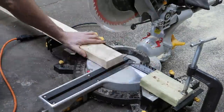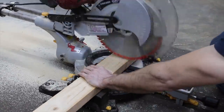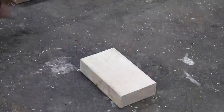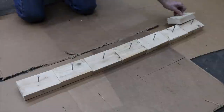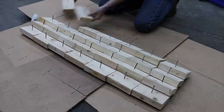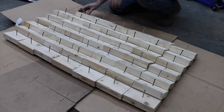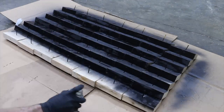The first test we'll be conducting is to test the holding strength of each type of nail and then each screw. I'll be using untreated 2x4s from the same stack of lumber to help make sure the test results are accurate. Since wood varies a lot, we'll be testing seven samples of each type and throwing out the high and the low numbers to get rid of the outliers. I'll be driving the nails and screws completely through the 2x4, then spray paint the test samples black so we can easily see when they begin to lose grip. When a nail is pounded into wood, it displaces the wood fibers, and the pressure exerted against the shank by the displaced wood provides the holding strength.